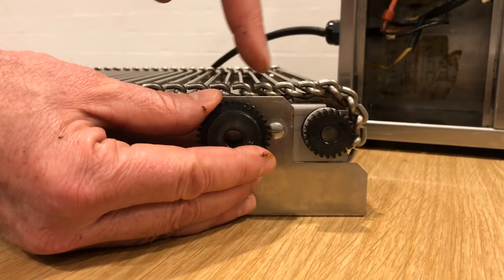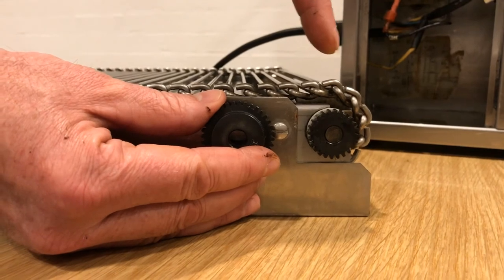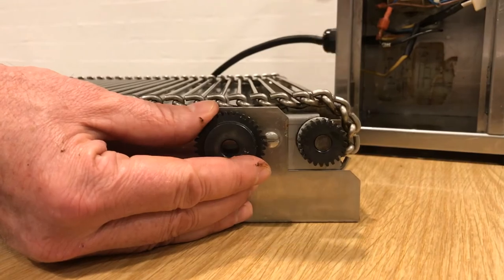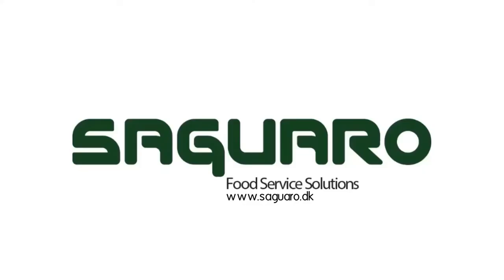Here's a bonus. The machines are 40-second toasters, but if you switch the motor gear and the conveyor gear, they become a 20-second toaster. That machine can be used for a 10-second toaster, and this machine can be used for a 15-second toaster.